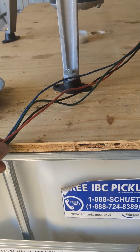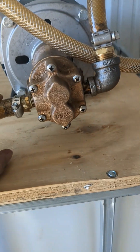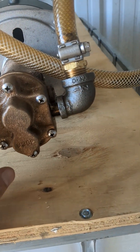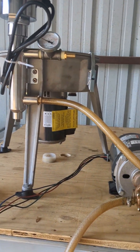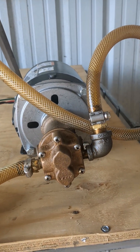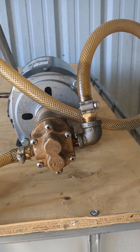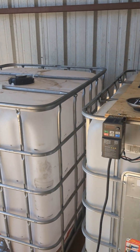I've got a cover for the wires, I just haven't put that on yet. This is a gear-style pump, which means you've got two gears. One's going to be about right here, one's going to be down here, and those gears are going to suck the oil through and push it down our hose, which in this case is connected to a centrifuge that purifies oil. With this motor, we're going to have an output of between 40 to 50 gallons per hour. Honestly, it's a little slow when collecting oil from a mechanic shop. The best case for this electric motor is to transfer oil between two containers in a shop.